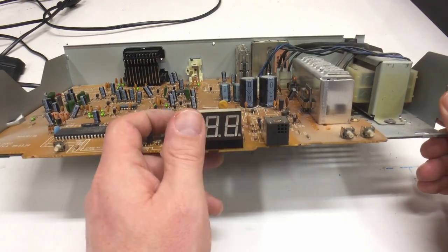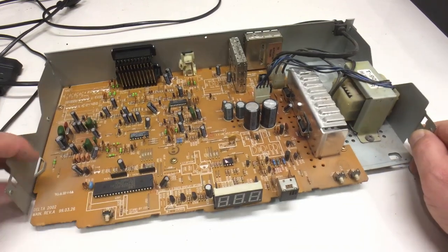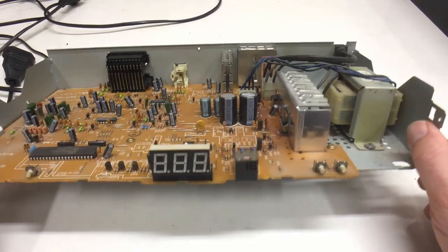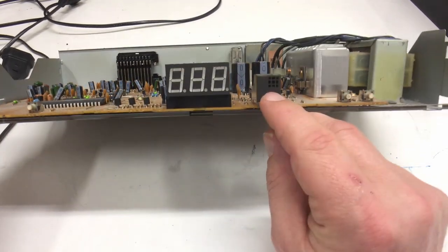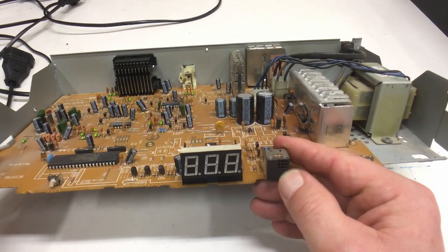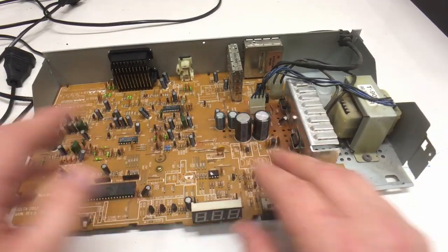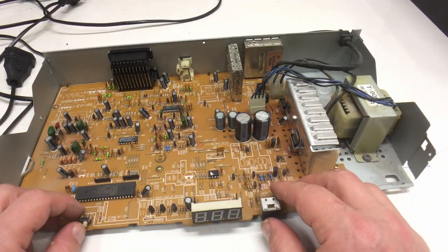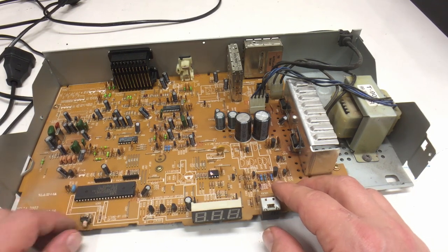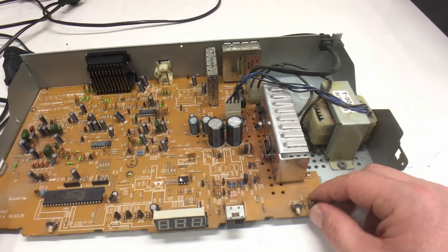That's the almost dead LED that we saw in green. This looks like the receiver for the remote, though it doesn't look like an IR receiver — we'll have a closer look; we'll get the board out probably. Our standby switch. Channel up, channel down. Big heat sink and a transformer for the power supply, which is fused of course.